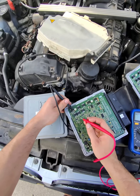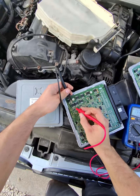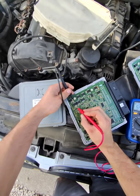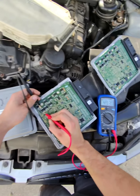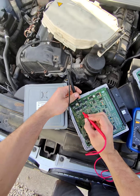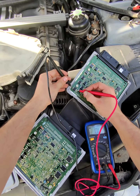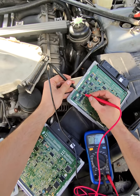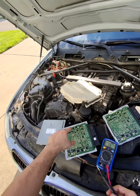There should also be no continuity between the top and the left pin. This bad transistor has continuity between the top and left pin. But if I check another good transistor, it has no continuity — just like the others. No continuity. So you can do those two tests to figure out if your transistor is bad.